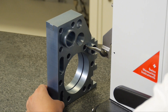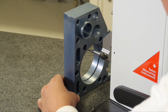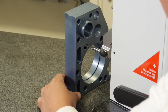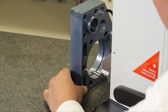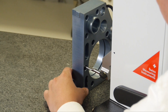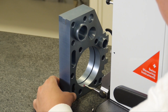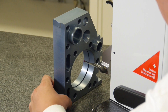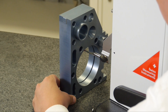What the gauge is currently doing is presenting all of these bores in one single Z-axis, and when we rotate the part 90 degrees, it will present it in our full 2D image. I'll measure this larger bore to complete the first part of the process — sweeping the probe, driving up, bringing it back, releasing.